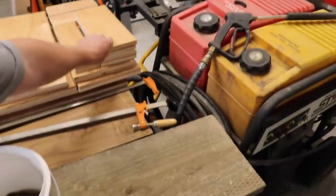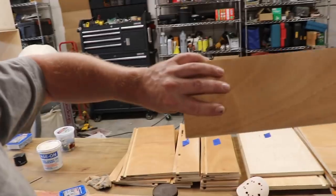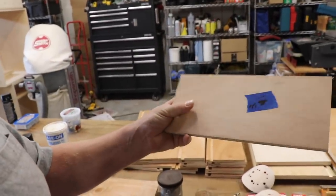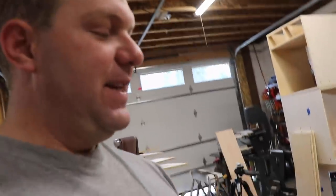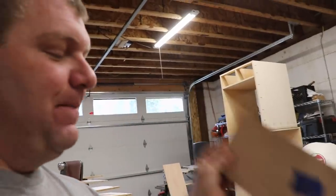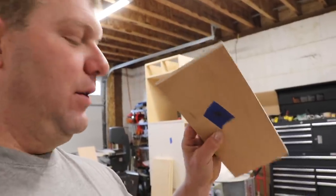the fronts and the backs. So this side of the drawer is unfinished, and this is the inside of the drawer. So where the front of the drawer itself sits, we're going to have a finished drawer front. So this is just the drawer itself, and then we'll have a finished piece of wood that will go over that, that will be visible from the outside. And of course, the very back of the drawer, well, you'll never see that. It's gonna be buried in the cabinet unless you remove it. So those two sides is what we're gonna use for the pocket hole joinery.